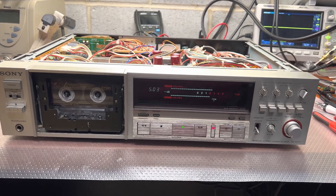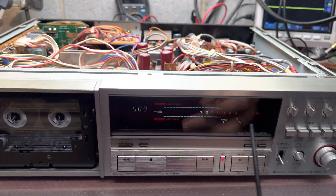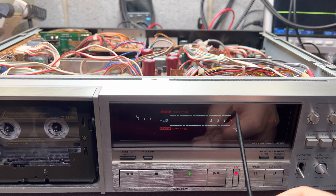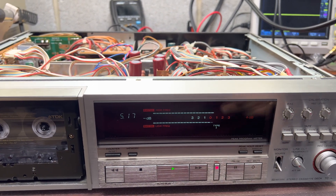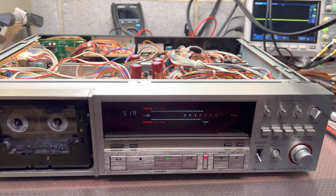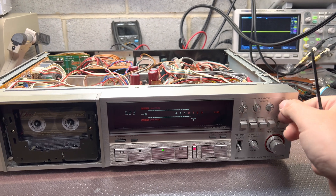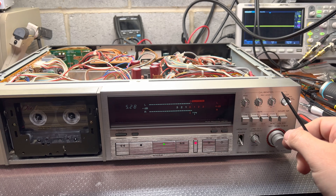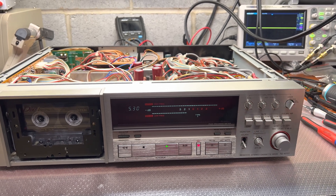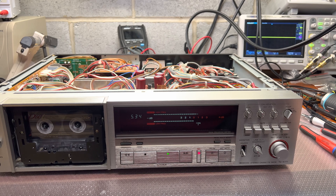Hey guys, I finally found the adjustment. So the last one, we had to adjust this spot, 542, to have a high one segment above the low. You've seen we just adjusted the levels between one and 10 kilohertz — it now calibrates properly. Zeros here on the levels, zeros here on the bias. Good, perfect.